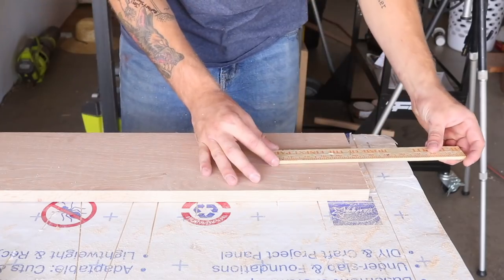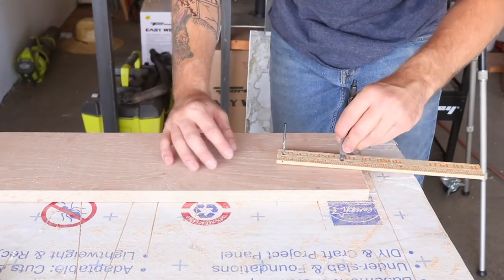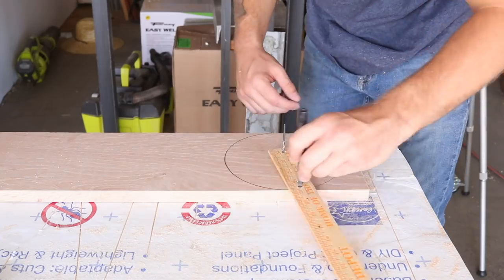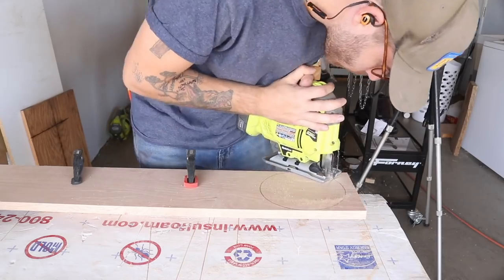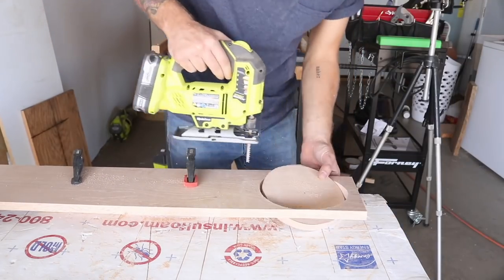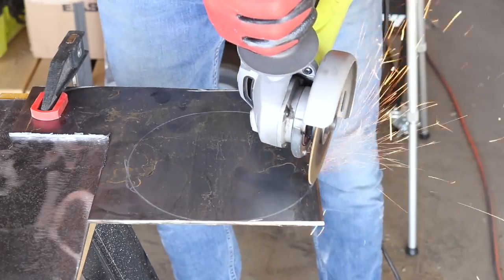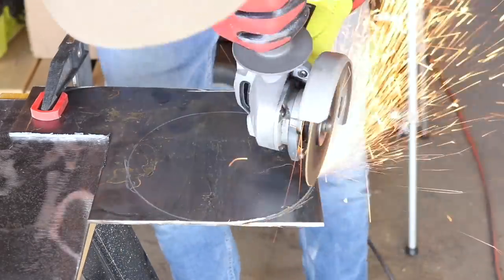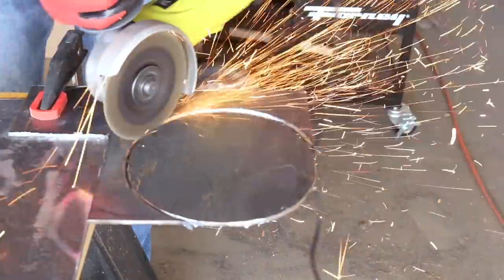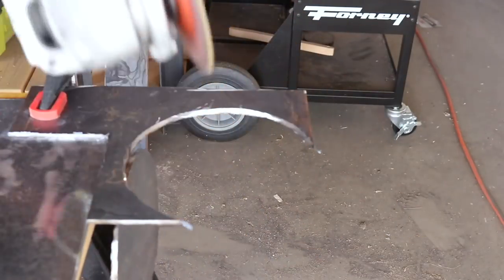The second thing I'm making is a stand for the kettle. If you're making pour-over coffee, it's always great to have a place to store it and set it for when it's hot. After using a makeshift compass to make a circle with a radius half an inch bigger than the kettle, I used the jigsaw to cut that piece out. After it was cut, I sanded it down and then used it to trace the line for the metal base. You can cut circles in plate steel really easily with the angle grinder — just like before, you want to make really shallow passes, this time even shallower so that you don't pinch the blade as it's rotating.